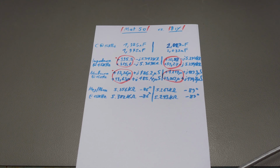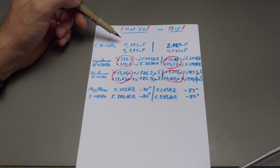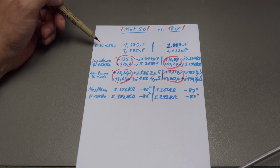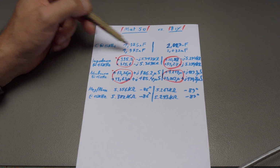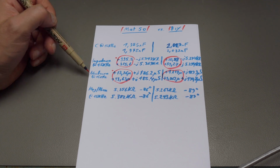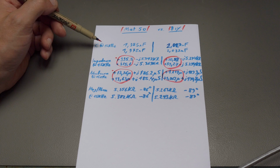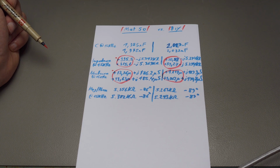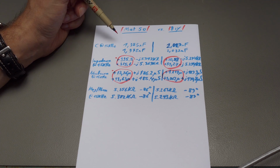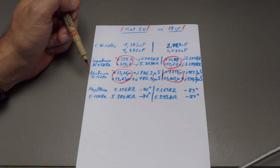And I'm back with new batteries in the LCR meter, and I basically used all the info that the Peak Atlas LCR45 shows. Of course, it shows you the capacitance by default, and this is what you saw earlier before my batteries ran out. But you can also measure impedance, admittance, and magnitude and phase, I think. Everything measured at 15 kilohertz. And as you can see, capacitance very, very similar with my aluminum foil variant. Magnitude, phase also very similar.